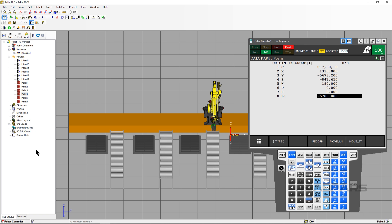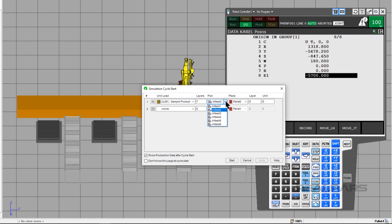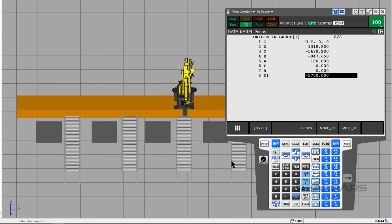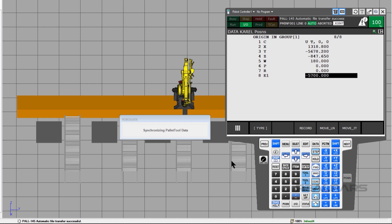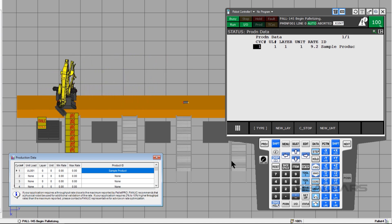Let's verify that our robot will palletize on infeed 1 and pallet 1. Click the Play button. Make sure that you only run infeed 1 and pallet 1 due to the others not being set up yet — they will probably fault if they are run. Click Start and watch the simulation. The robot will go to the Perch position, then go to infeed 1, then to pallet 1, and stack on pallet 1 and infeed 1.